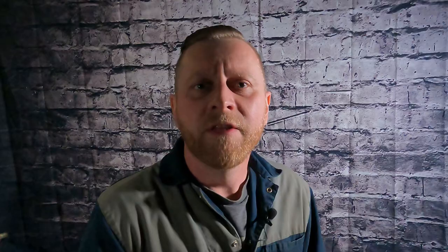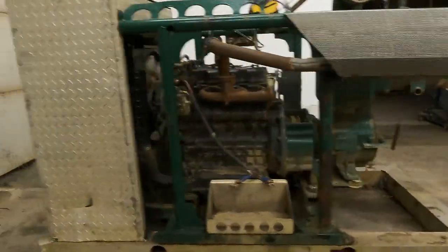I built this pump around 8 years ago from a bunch of junkyard material. The pump itself is a salvage piece. I had to rebuild the impeller and make an adapter shaft to go from the engine to the pump. It's rigged together with a 4-cylinder Kubota diesel taken out of a reefer unit — this engine came from a cooling unit hauled by a semi-trailer. Lots of these cooling units have a 4-cylinder Kubota diesel mounted on the front to run an air conditioning pump. I used this engine and mated it to that Gorman Rupp.